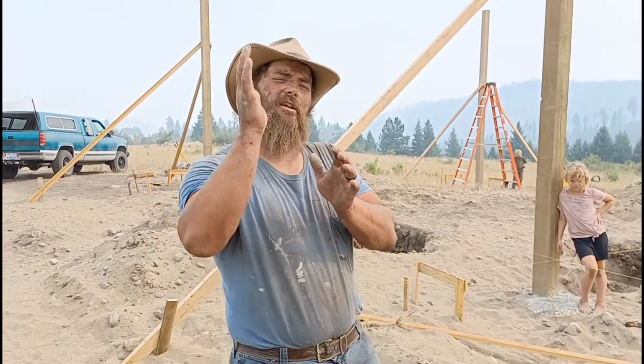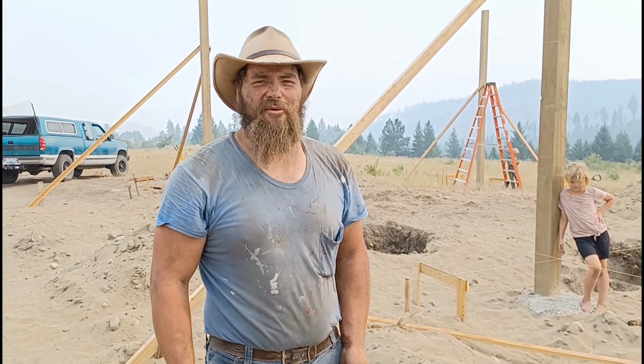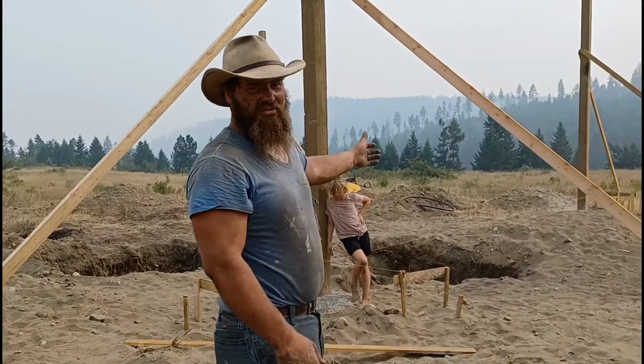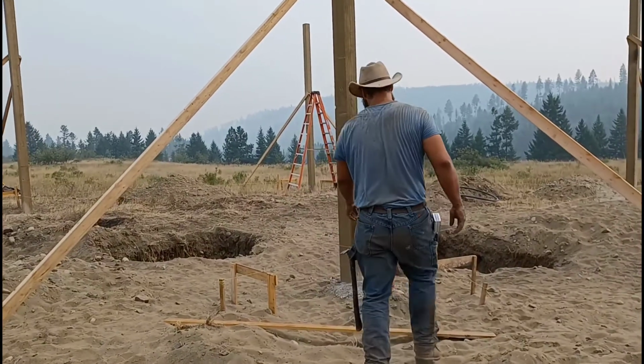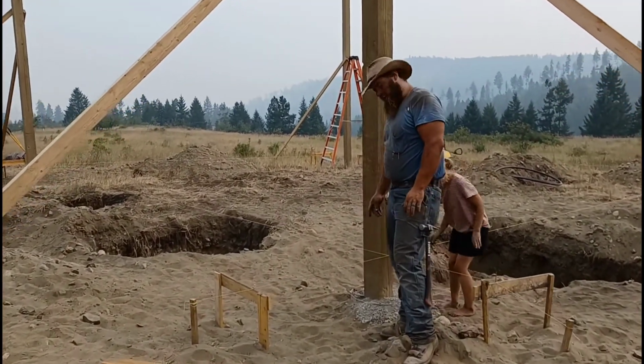You know, a pole has a little bit of crown here and there to it. We'll be pulling it as we go. But yeah, we wanted to show you our progress. So we set the posts in the ground. The 20-foot posts, we're going to have 15-foot tall walls so we can have 2 levels inside of this pole barn. And then what we've done is we backfilled the holes that I dug with the excavator.